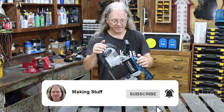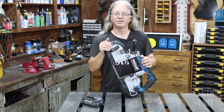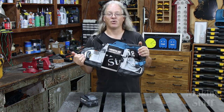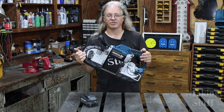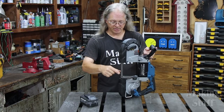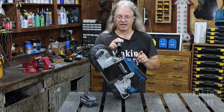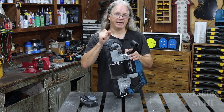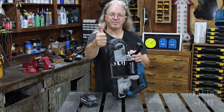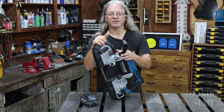I really do like this saw — it's a great little saw. They've made a lot of improvements over the older Porter-Cable saws, and the main thing I like is that it is cordless. It's not any heavier or bulkier than the corded version. One caveat: if you have an upright table or fixture that holds the saw, the bolt patterns on the handles and the guide plate do not line up, so you'll need to make modifications. If you liked the video, please smash that like button and consider subscribing so you don't miss any upcoming videos — thanks for watching!